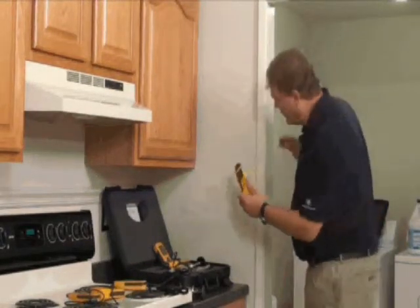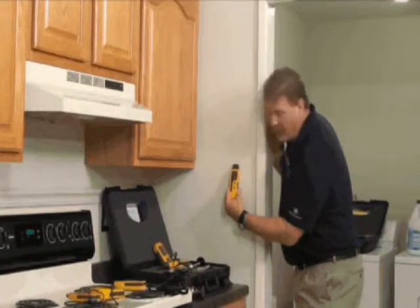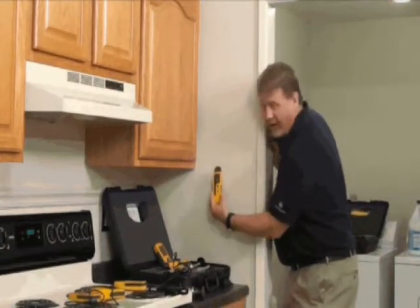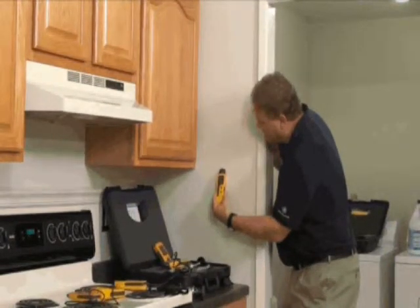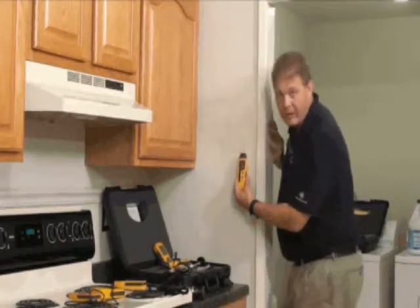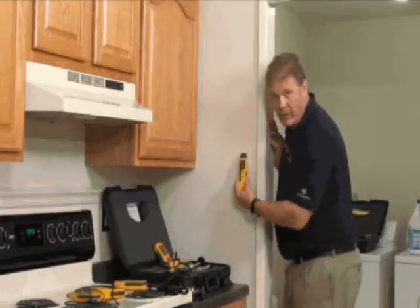Let's go to a wall surface now. You would just use it by putting the back of the meter on the wall, tipping it up until it sits flat. Move the meter around like this, as opposed to dragging it. Dragging it can potentially harm the material, make a mark on the material, and eventually wear out the back of the meter. There's also an audible alarm — if you hit anything in the red zone or wet zone, it'll go off.